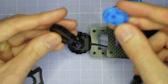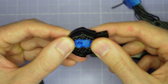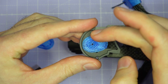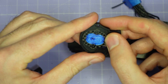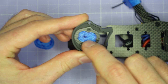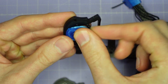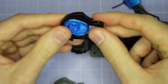Install the TPU gummy into the camera plate like this — it should just pop through. You can see we're installing it from this side and it comes through flush with the carbon camera plate on the other side. You want the little M2 hole towards the front of the camera cage. Once you've done one side, do the other side exactly symmetrically and now you have the camera cage nicely assembled.